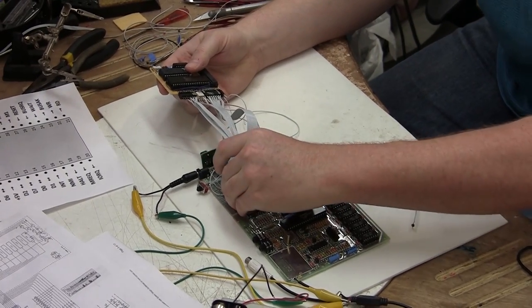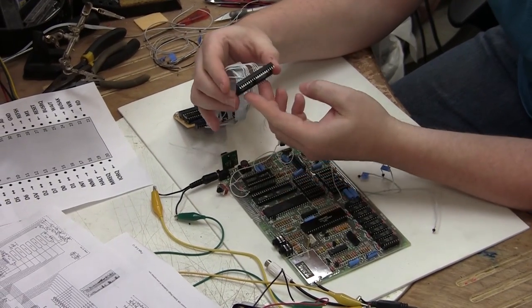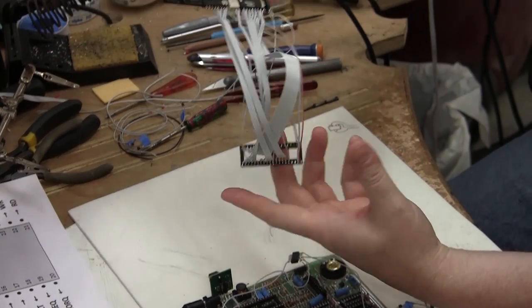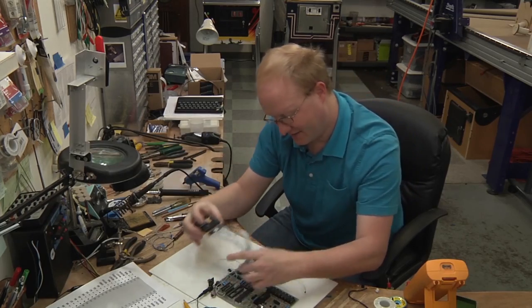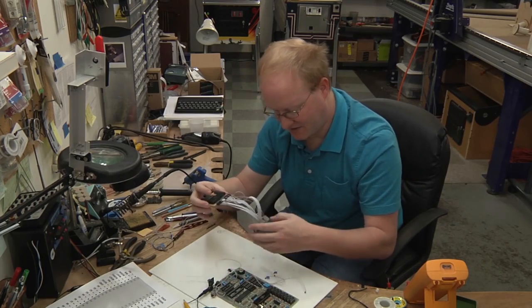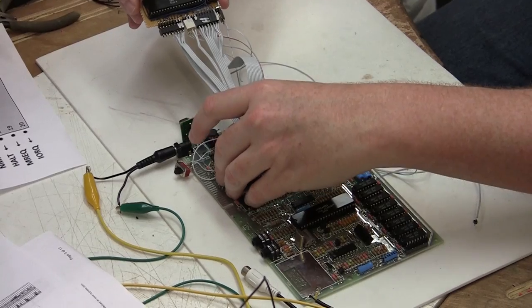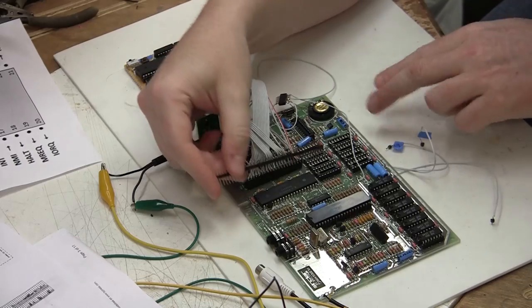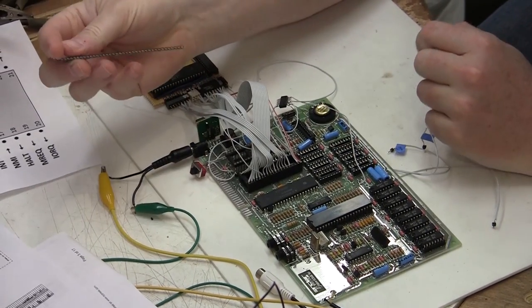This is an expansion socket I made. I took a regular socket and soldered wires to it, so you can plug in all this stuff — see how the ROM and RAM are missing? You can plug this in as the Z80 and everything will still work because it's all on a bus. The reason I didn't use a header is that pressing it into those sockets would permanently bend them out and you wouldn't get a very good connection.